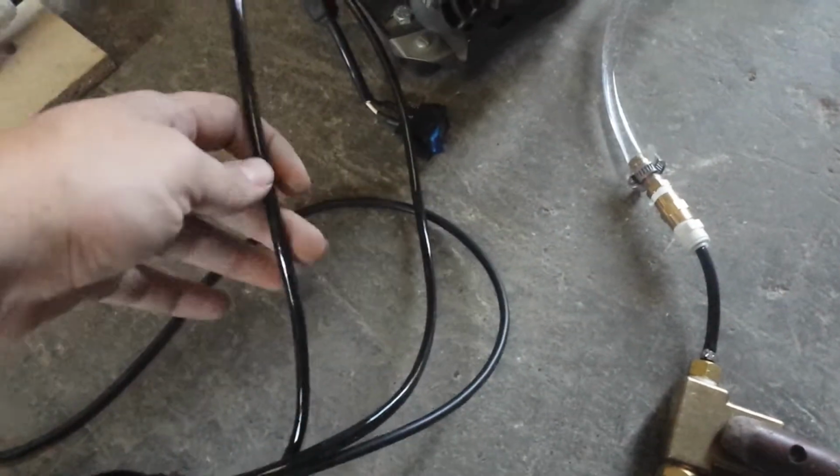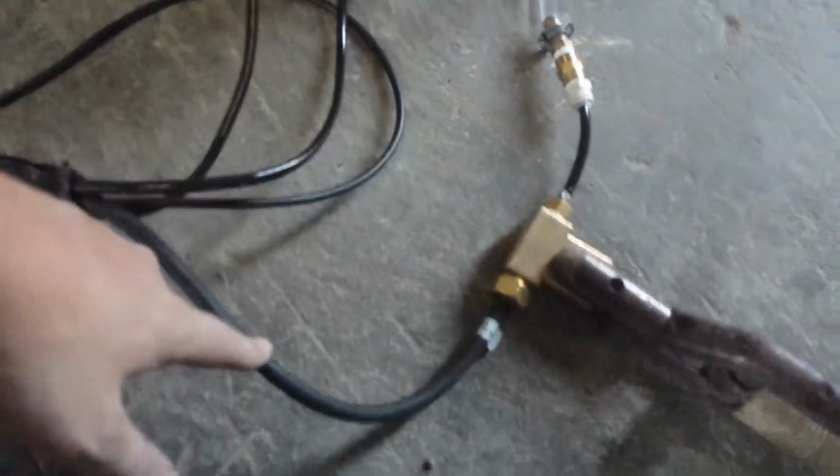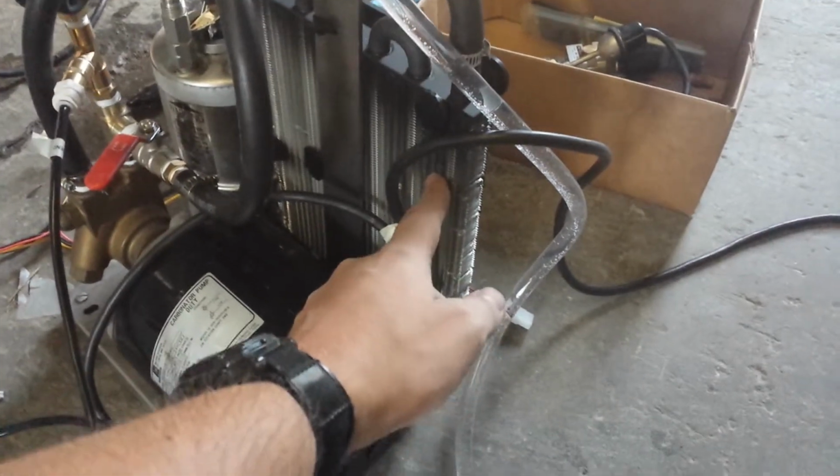So there's a water send line here that sends cool water out to the torch, and then the warmer water comes back along the power cable, cools the power cable a little bit, it gets a little warmer, and it goes back through this return line through a transmission cooler with some fans on it, and then back into the tank, and then it's recirculated.